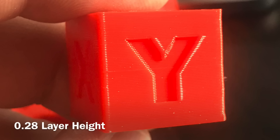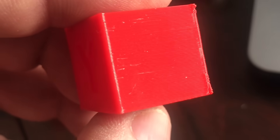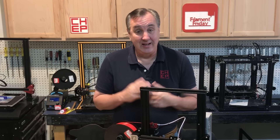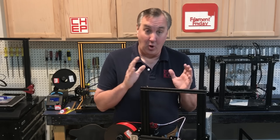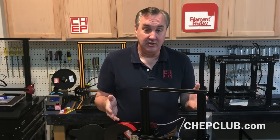In fact the Y looks a little bit smoother and the sides are nice and smooth. I love the way this looks — a super tight belt really works. So how tight is tight? Based on these tests, it can't be tight enough. You can go too far and stretch or nearly break the belt, and that would be bad during a print, but the tighter I got these the better my prints got.